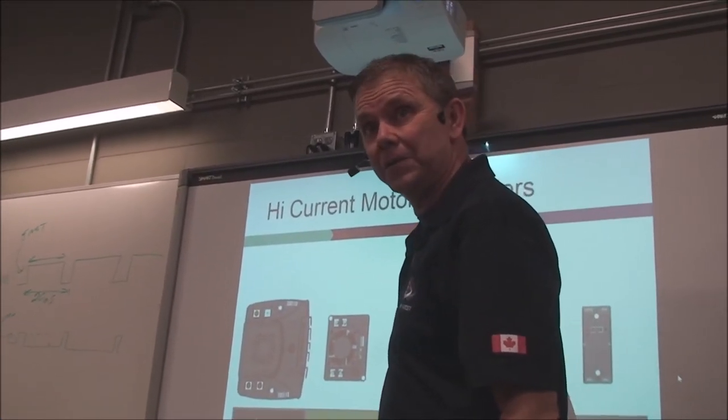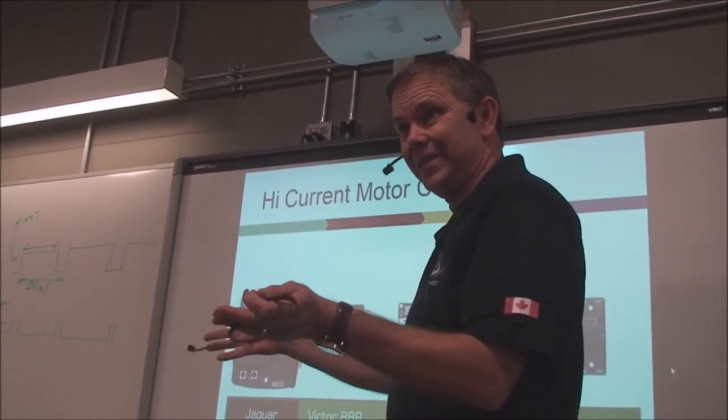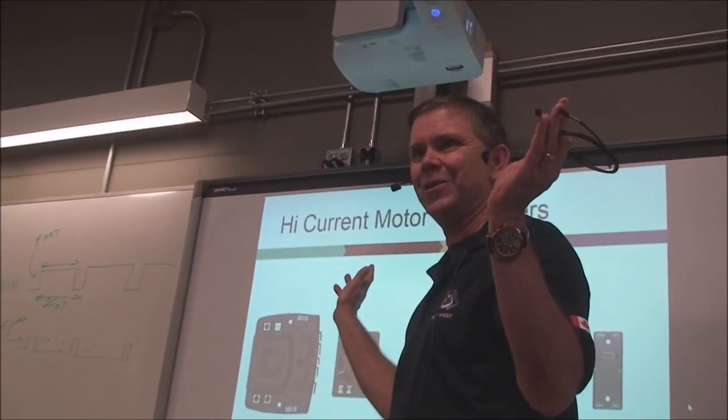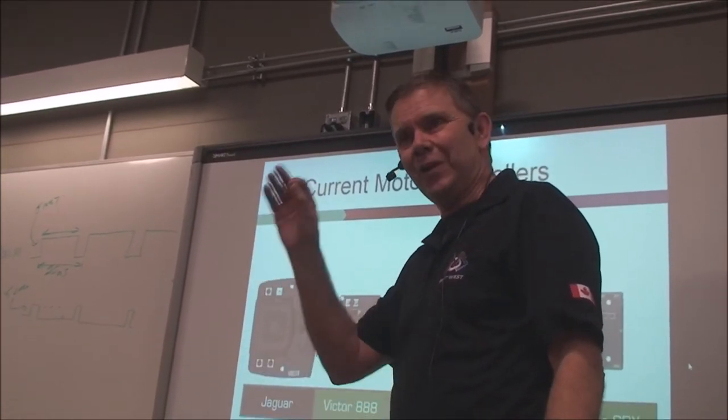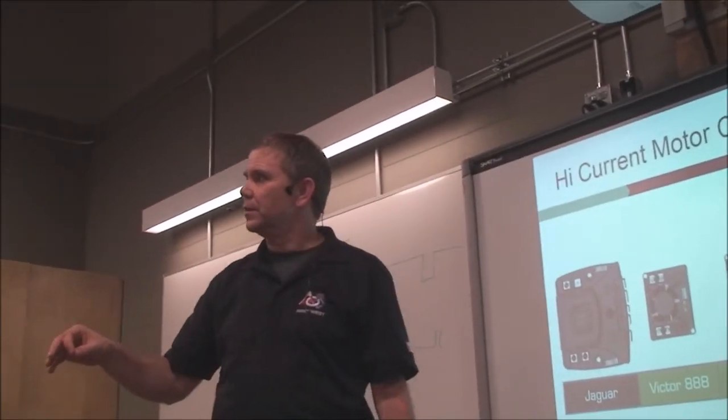They all default to device 0, which means when you first hook this all up, every CAN bus device is device 0. And then when you go to talk to them, they all say device 0, and it just doesn't work for you. So I'll show you in the next class how to actually program your CAN bus devices to whatever number you want them to be.